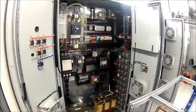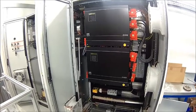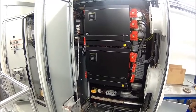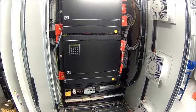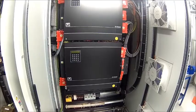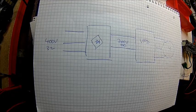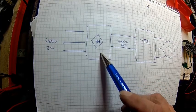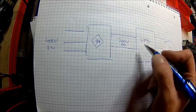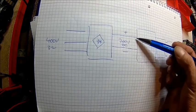This is the mains incoming section here, and that is the drives. There is a mains incomer and a motor drive. The bottom drive is the mains incomer and the top drive is the motor drive. I'll put a little drawing into the video to show how they are wired together. What we have here is a regenerative drive. We've got 400 volt mains coming in here, and this is an active rectifier — essentially a drive in reverse. We've got 700 volt DC between the drives, and the VFD is not fed by mains; it's actually fed by the 700 volt DC.